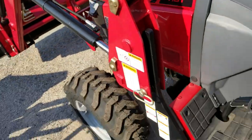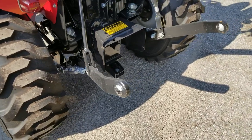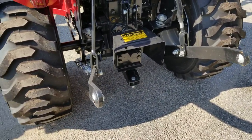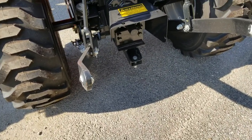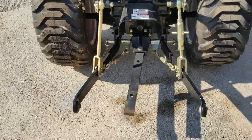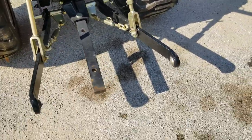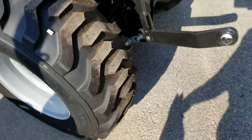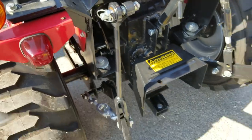Three-point lifting in the rear — cast iron rear end. Three-point lifting on the Max 26 XL is going to be exactly 2,205 pounds, so a little over 2,200 pounds. The three-point lifting capacity on the E-Max 25 in the back is only 1,320. This is still a great tractor. Both of them come with standard drawbars — you can see that one's installed right here, and this one can be installed; it's got a spot to get it out of the way when you don't need it.